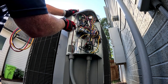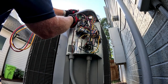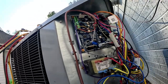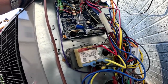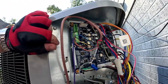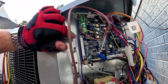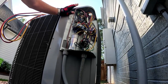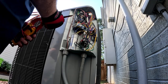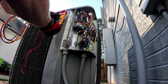It's 24-volt wired. The wire is in there pretty tight — cut that wire off too short. We've got the thermostat switch with heat strips, but it doesn't look like it's wired that way. It's wired up for 24 volts. Both zones are open, all the dampers are open, and the zone board is sending a call for Y1 and Y2. So let's confirm that we are getting Y1 and Y2 to our outdoor unit.